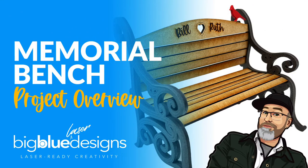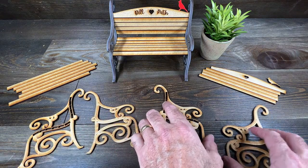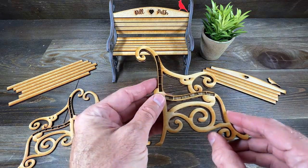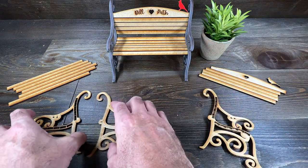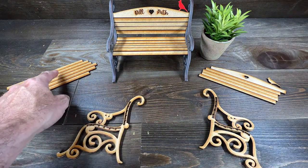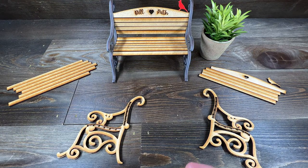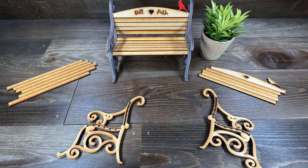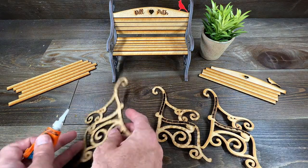All right, let's jump over and assemble it. The first thing we want to do is go over all the pieces. We've got the four end pieces right here — one, two, three, and four. These two go together like this: when you have it correctly, you'll have slots on this side and scores on this side. That's how we're gonna glue that together. Same thing with this side here. Then you've got six slats for the bench, four slats and the top piece for the top. I'm using Gorilla Glue super glue gel — it lets things go together easily while you guys are watching and it's nice to make things quicker, but you can use whatever you want. So let's start by gluing the two sets of ends together.